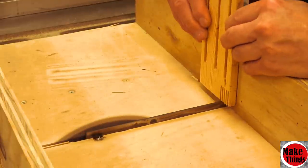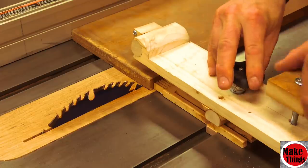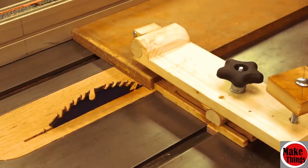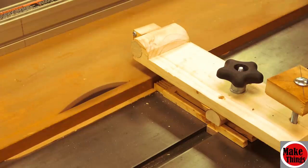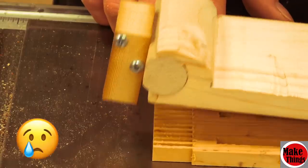It wasn't until this point that I decided to add a horizontal featherboard to ride below the fulcrum. Like before, I used my jig to add teeth. So now the question is: did it work? Actually, very well — the featherboards were able to push the wood both down and against the fence. But I didn't like the angles of the teeth, and I certainly hated the way it looked.